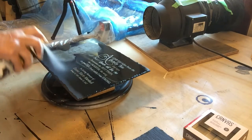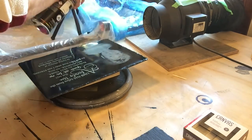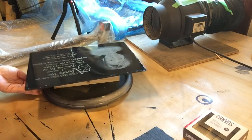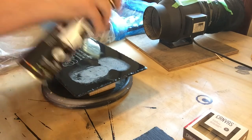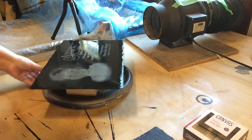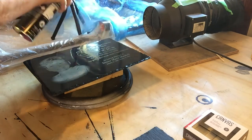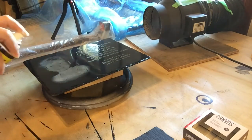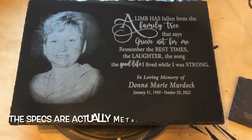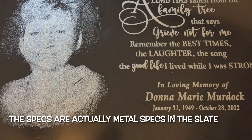I go in one direction, then spin the lazy Susan and do another coat, then spin again and go in that direction. If anything falls into your paint, don't touch it with your finger — you'll leave your fingerprint literally. Let the clear coats dry; you may be able to brush off anything that fell on it once dry. If it hasn't come off you can do a very light sanding with very fine sandpaper to get any little bits out, then give it another clear coat. You might think you're scratching the clear coat, but once you put another coat over it it's absolutely fine.